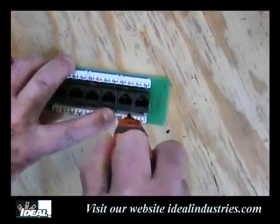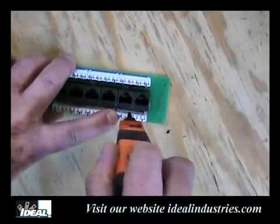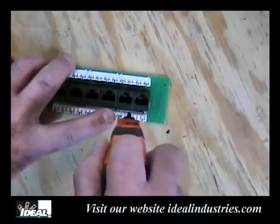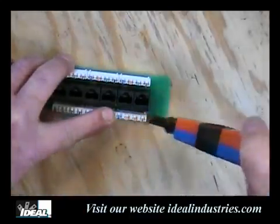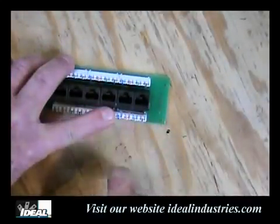They punch down and they insist on hitting it multiple times because they don't think it did what it needed it to do. There are what I call the flare people that punch things down, and then they flare the tool out to one side or the other like that, and they don't realize they're going to spread out this connection and can actually ruin it doing that.